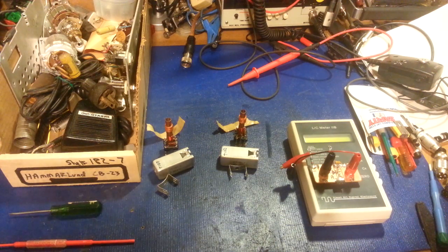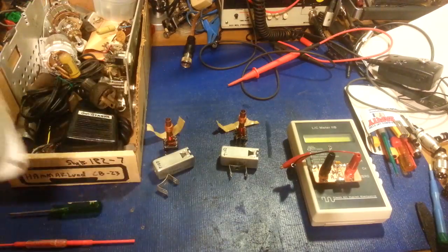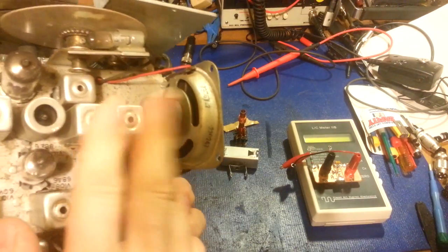I've run into it myself before, and I was thinking, yeah, it's a possibility. The problem is, in these radios — I happen to have this parts unit — these two transformers right here: the problem is getting these blasted things out. They're underneath the wafer switch assembly, really crammed down in there.